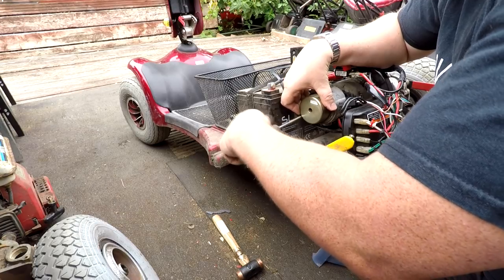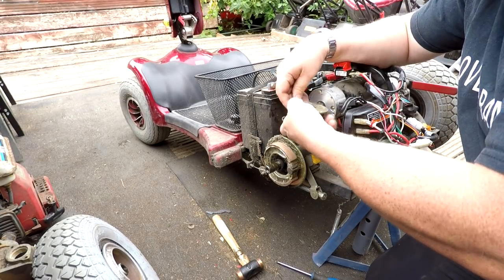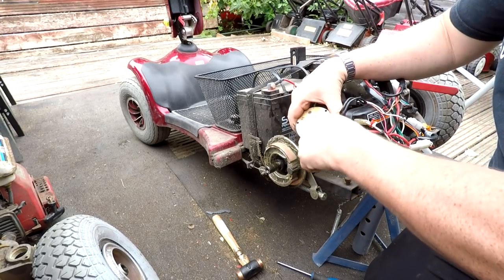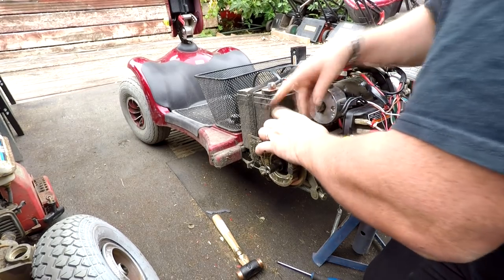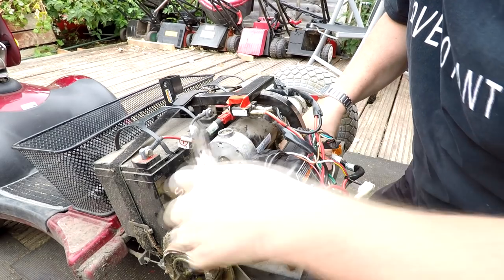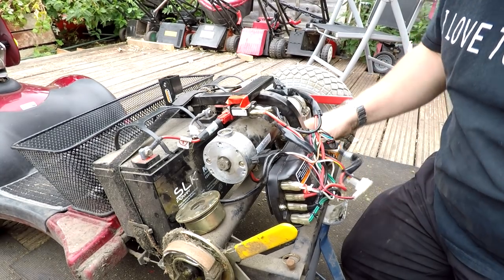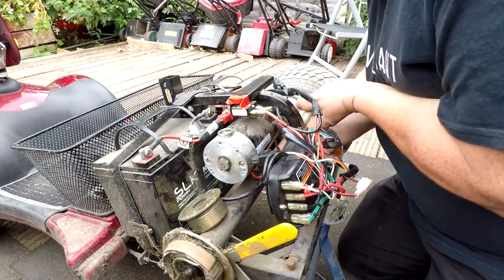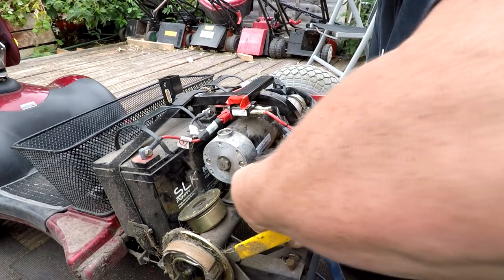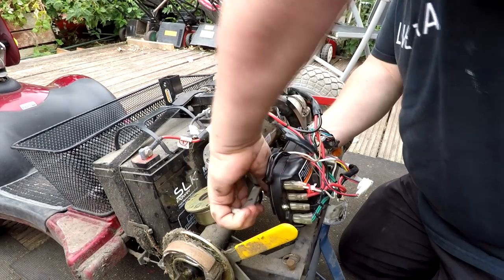There's only three screws on this one. What we've got here is a little solenoid brake, so there'll be a friction plate inside. There's the motor — turning freely — but this plate looks like there's a load of debris in here. It might have even seized, I'm not sure yet. As he said it cut out on the thermal cutout, this could have seized up, overloading the motor and tripping it on high current. Not knowing anything about these types of motors, I haven't got a diagnosis guide apart from the little bit of information I found online about a similar model.